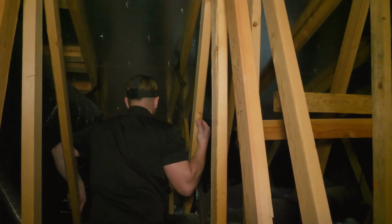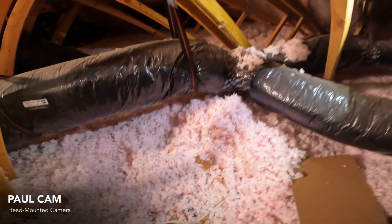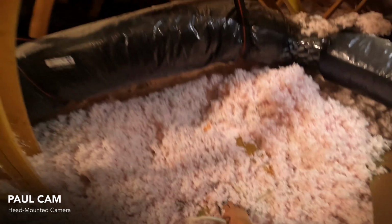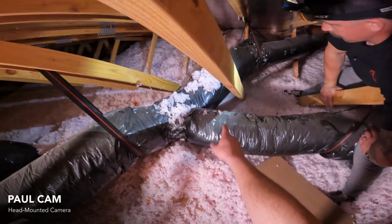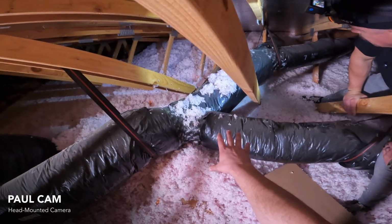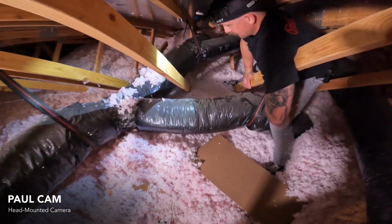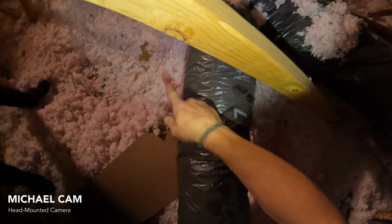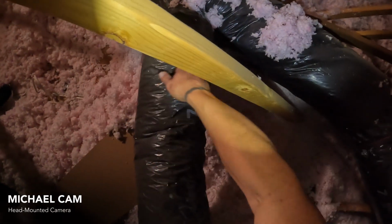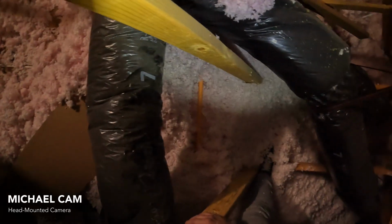So the air conditioning duct is where we were maybe thinking we were going to be able to go? Possibly. Okay, Michael, so we've scouted out this area in the attic. This is our smoke detector in the hallway, correct? Correct. We were thinking we might be able to go right here where this air conditioner duct Y is happening. That's in our way. We're thinking we might be able to jump over into a different bay. Is that viable? Unfortunately, no. The sprinkler line that we saw in the hallway shoots over and crosses right over this bay that we were trying to go in.